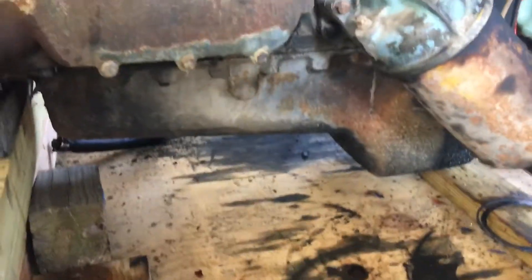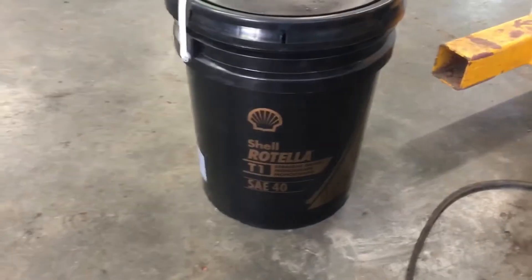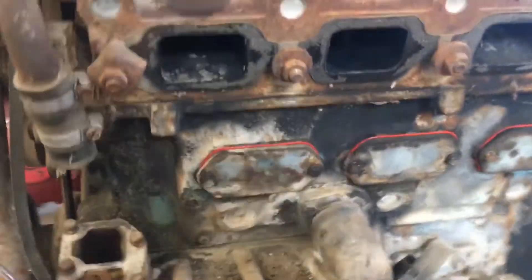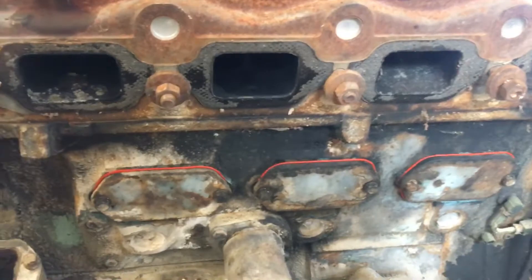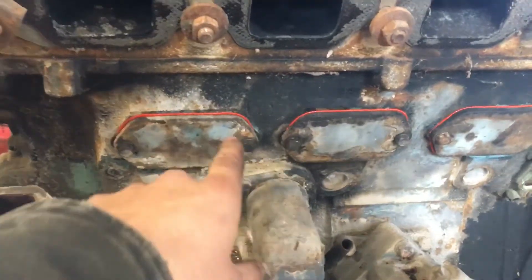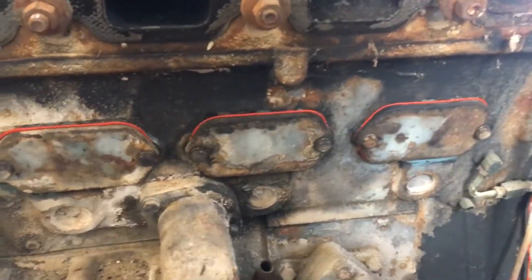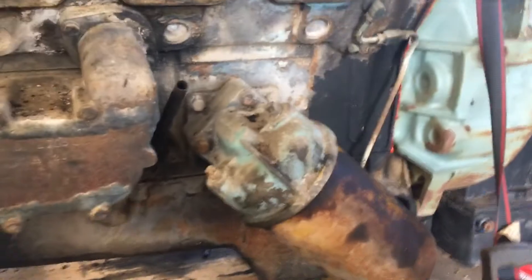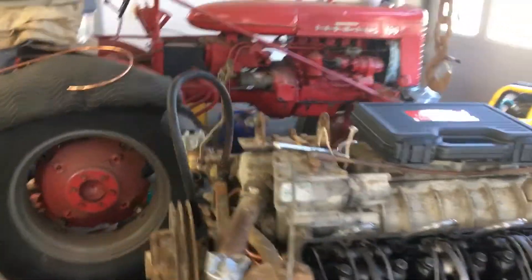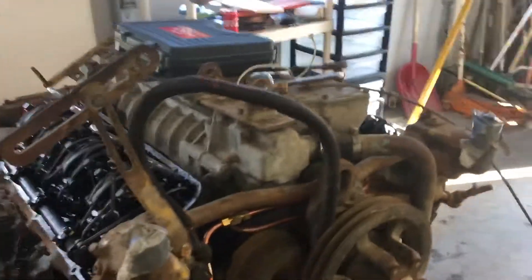It's all sealed. I do need to lift the engine up so I can seal the oil pan and then put five gallons of oil in it, which is Rotella straight weight 40. I also took the exhaust manifolds off so when it's running I can see which cylinders are firing and how they're firing. I also took off the inspection covers, looked into the cylinders, and checked out the pistons and rings — they all had normal wear. I got a new oil filter.